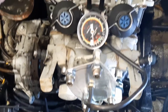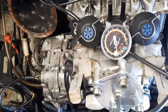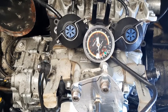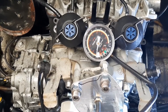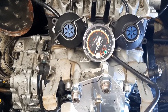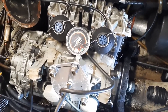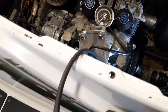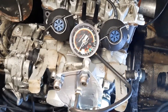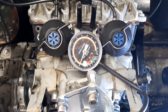Everything should be tight. We're going to go ahead and apply the pressure — I'm going to open this valve slowly. We've applied five psi and I have closed the valve to isolate this system from the supply. We'll watch that for a couple minutes. The manual talks about three minutes for this test.